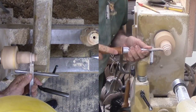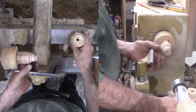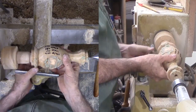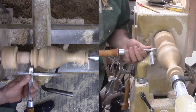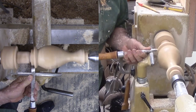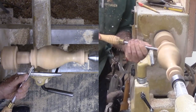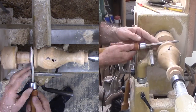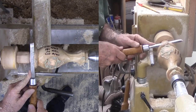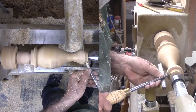Now that the wood is dry, I have to re-cut both tenons. Since I drilled from both ends, I do not have the original center divots as a guide. I grabbed a wood mandrel mounted to a threaded wood faceplate. The mandrel is slightly too large, so I am cutting it down to fit the bottom hole. My set of wood mandrels is quite handy. Once I trim them too small through use, I will simply face them off and add new pieces of wood to serve as the mandrel.